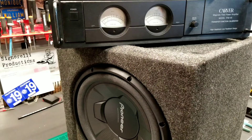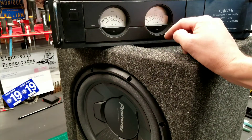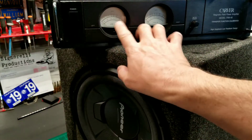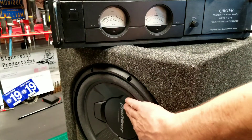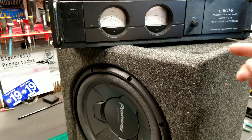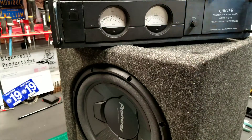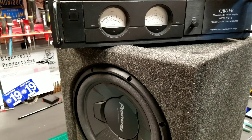I was getting my peak power at about 40 hertz, so I'm going to run a 40-hertz test tone and adjust my gain to see what I can get as far as output in watts. This is left and right channel but I'm bridged. I'm going to push it, avoid clipping, and watch what I get on the needle. Let's start that 40-hertz test tone - three, two, one.